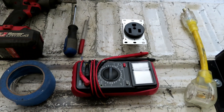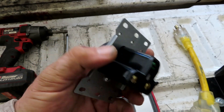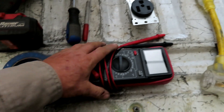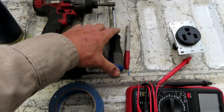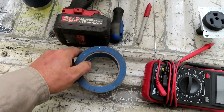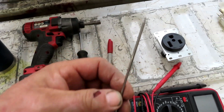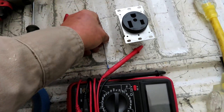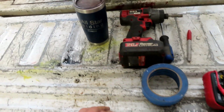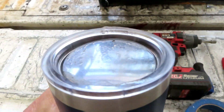To get this done, it's not really that hard. Obviously you need your 6-50 plug - it's only three wires. Make sure you get the kind that's got a bracket around it because it's going to make it easier to bolt in. You may need a meter, a number two Phillips screwdriver, a Sharpie, some tape to label your wires, and a sharpened piece of tungsten for marking where you need to cut the hole. You're going to need a 5/16 socket to take the cover off the generator. And of course, you're going to need a beverage - I chose coffee.